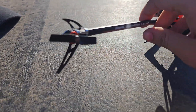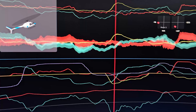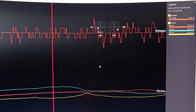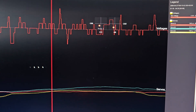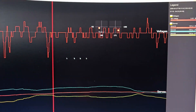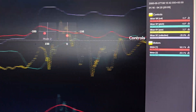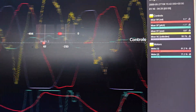I'm having a little bit of tail blowout, and I don't know if that's just the motor or what. I figured I'd go ahead and check my black box from that last flight. We've got gyros at the top, gyros pre-filter under it — you can see the filters are doing a good job. I also put my BEC voltage, which is the 5-volt rail, and it seems stable. It doesn't drop or rise very much, just 5 volts. So the BEC on the ESC board seems up to the task. No issues there.